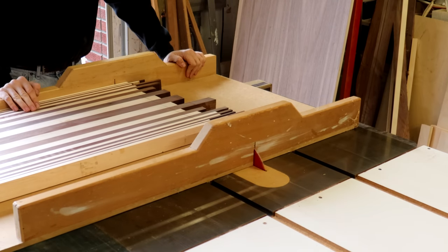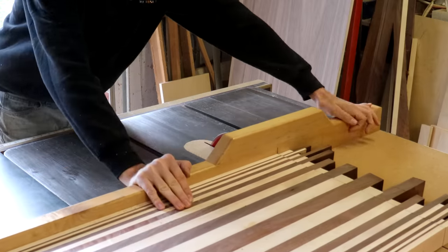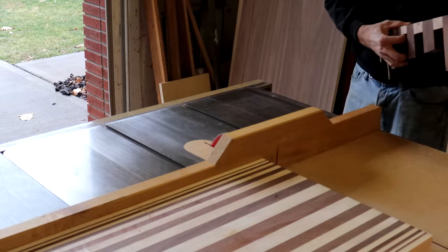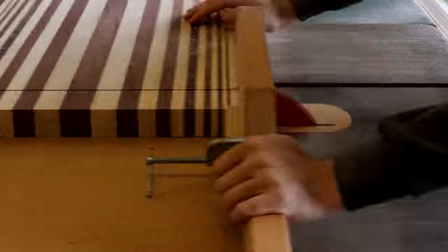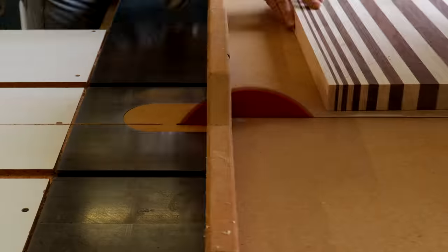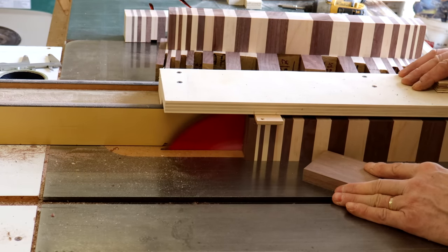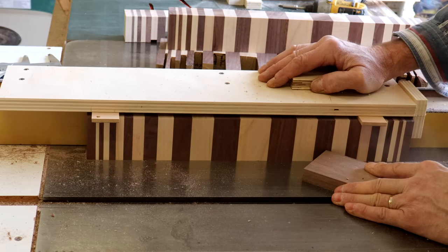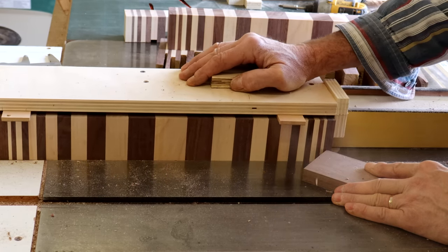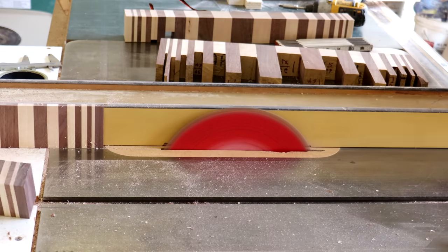Once that final joint was dry on both boards, the next step was to take them to the table saw and cut them into two and a half inch strips. That two and a half inches is going to be the final thickness of the end grain cutting board — this is how we're achieving the end grain. We cut all the strips and then stand them up 90 degrees, then repeat essentially what we did at the beginning by cutting these strips into the same thicknesses as the pieces they're made of. We made a custom push bar to push these through the table saw for a nice even cut, and it worked out pretty well — the thinnest ones were the most difficult to handle.